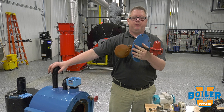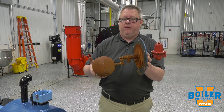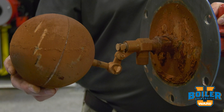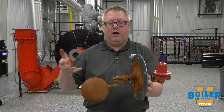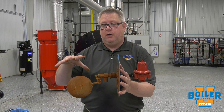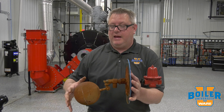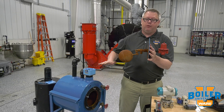Let's start with one of the simplest: a trough valve. This is a float-operated valve where the valve, due to buoyancy, rises on water rise and physically shuts off the valve. You can get a replacement at Rural King if needed. Typically you're not going to use this for a boiler because it's not rated for the temperature and pressure. But we often use it to maintain level in a feed tank so that incoming water can maintain a minimum level.